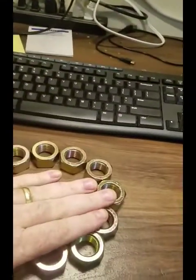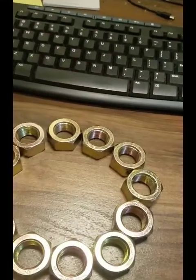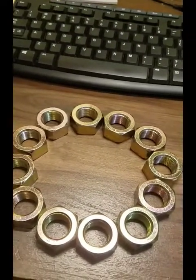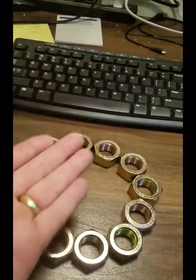The bottom plate will have something similar, but it won't have nuts in it. It will have shell holders embedded in it. And then you can slide whichever shell holder you need for the case that you're going to process in there, and that bottom plate will move up and down on its own.